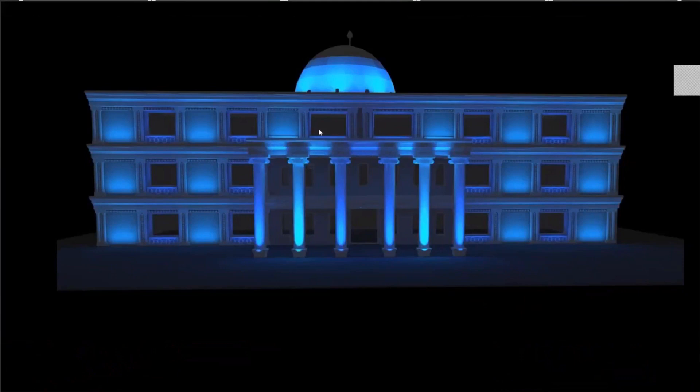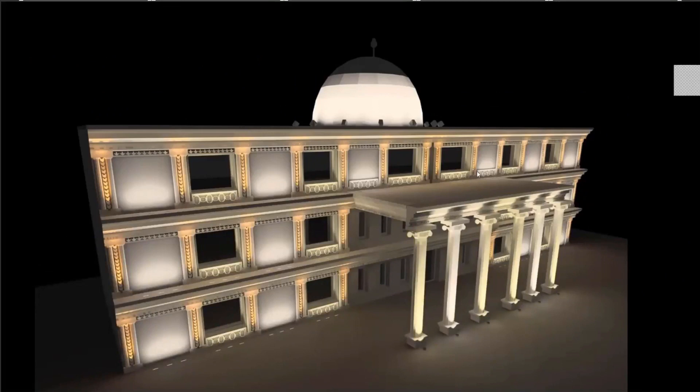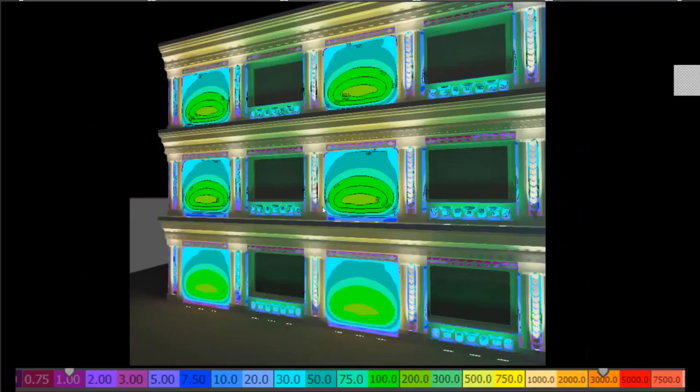This is another variant using cyan and a deeper shade of blue for the focal lighting technique. I've also added another layer of focal lighting by highlighting the pillars adjacent to the ledges using the Exterior Wash 100 individually — that is the beauty of focal lighting, as the first thing you notice are those pillars. This is the same project simulated using the tunable white variants, with a combination of 2700K, 3000K, and 5000K light fixtures. The lux level distribution using grazers is naturally a gradient — starting bright close to the fixture and fading away — but still getting a good 200 lux near the fixture.